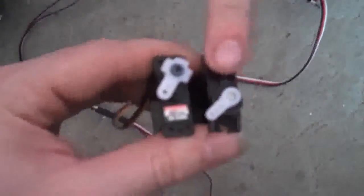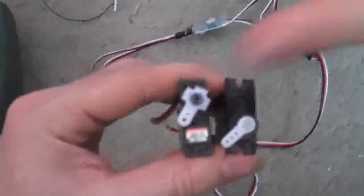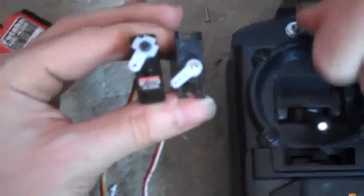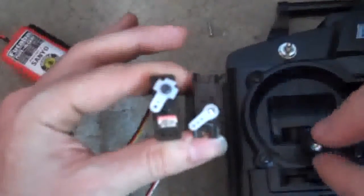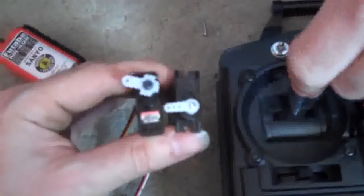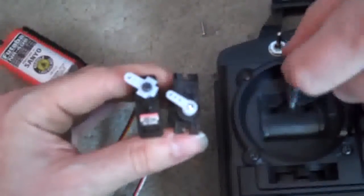And let's see, channel 5 and channel 3 from the splitter go into the mixing module, so that I can mix those two channels, the switch and the throttle. That mixer goes to a splitter, which will go into two speed controls, which we're representing by this one servo. The angle of the servo represents the throttle of the electric motor. The angle of this servo represents the throttle of the gas motor. So, demonstrate. With the switch in the down position, this at 0%, this at 0%. Throttle up, engine RPM to full, electric motors go to half, throttle back down. Electric motors to 50%, engine up to full, both are at full.